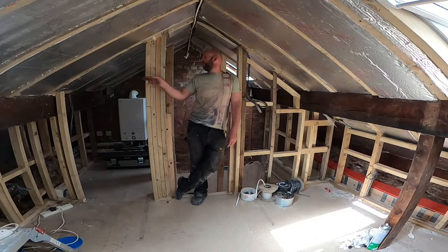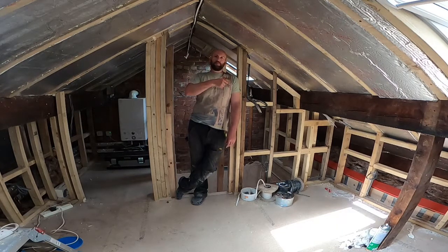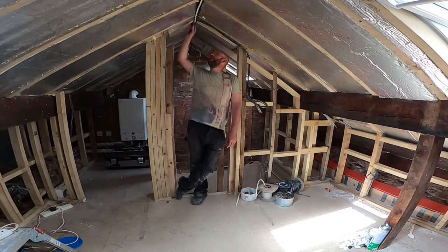So I've got a mains going up from downstairs into the cupboard light. The mains then go from the cupboard light to the bedroom light, and then from the switch position we've got the switched cable to the lighting positions, which is in the centre of the main bedroom and in the centre of the hall.